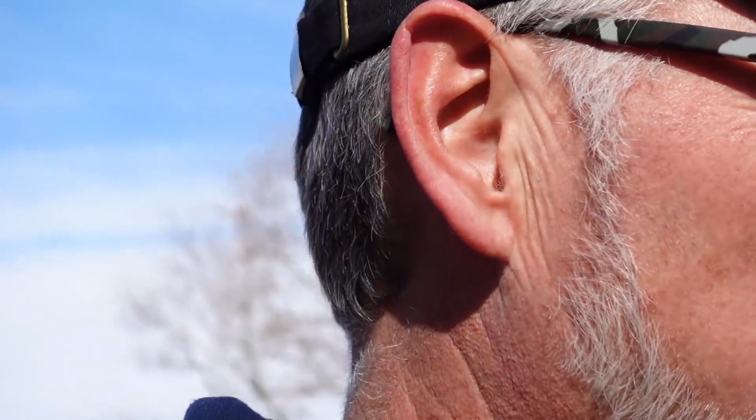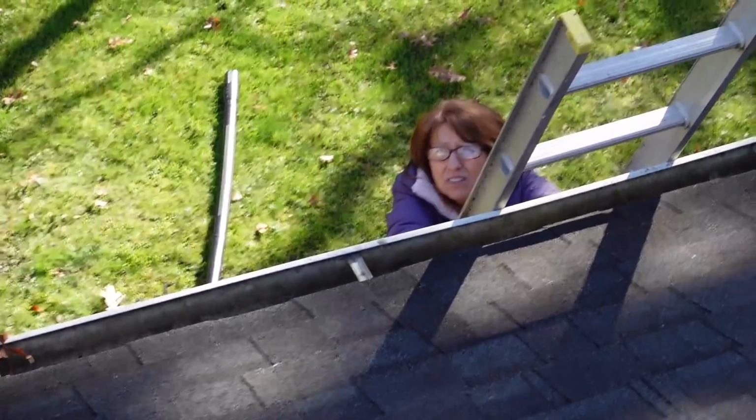And that's what I was saying. Make sure you put a cover on your chimney top, because every animal that can fly, crawl, or whatever will go down there, including mice, birds, bats, squirrels. There's nothing worse than when you fire up your fireplace or your wood stove, and all of a sudden you can't get draft, which is the smoke going out the chimney, and all of it backs up into your house. So that's the reason to keep stuff out of there and keep it clean.